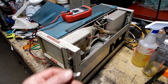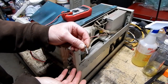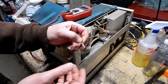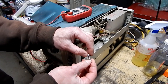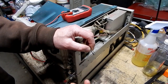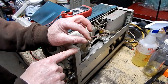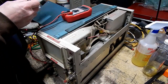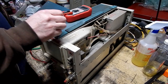This is a one and a quarter amp slow blow fuse, and that is what the rear panel calls for — 1.25 amp slow blow. I don't have a one and a quarter amp, only a one amp and a two amp. If I put the one amp in and it blows, that's not going to tell me much. Two amp is significantly larger, so not the greatest idea. But my suspicion is there's probably a short in the power supply and it's going to blow the fuse rather quickly anyway.